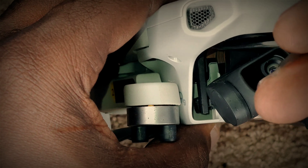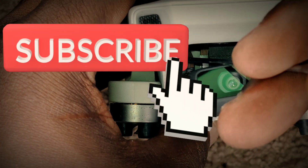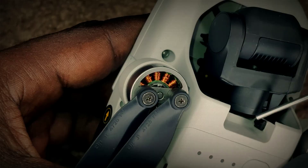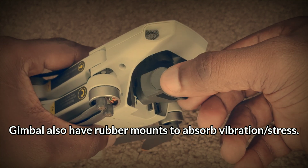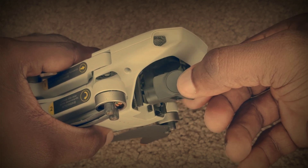So you want to make sure that these ribbons are taken care of and they're not torn, because you're gonna need them to transfer all that data moving back and forth between the gimbal and the rest of the drone. And finally, if you look closely, you'll notice that there are some rubbers at the bottom. This acts as a shock absorber, so just in case our drone bumps into anything and the gimbal sustains any force, those rubber pieces are there to make sure that the vibration is absorbed as much as possible.